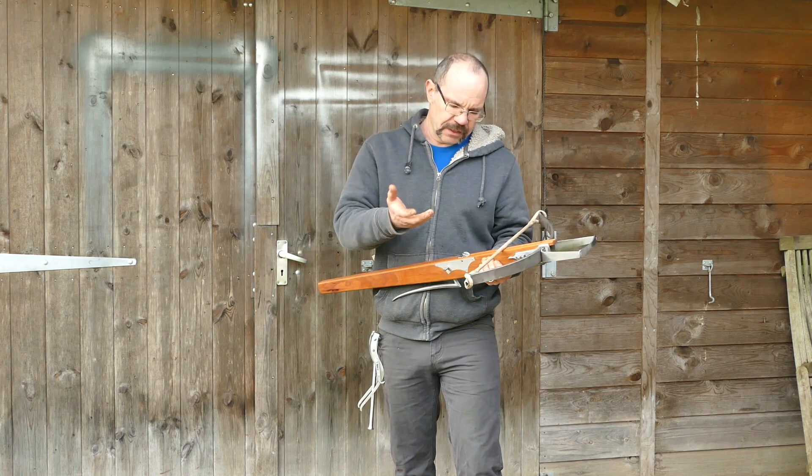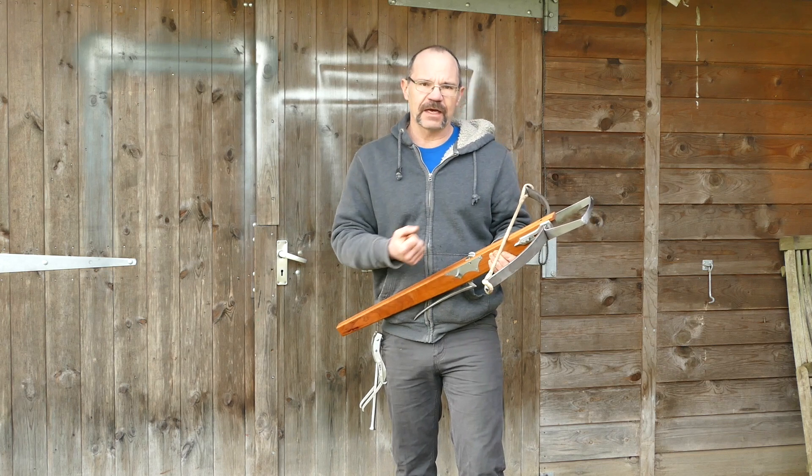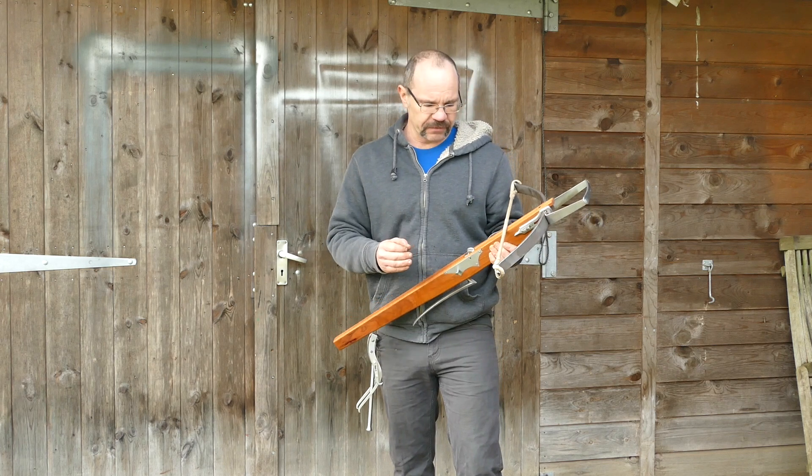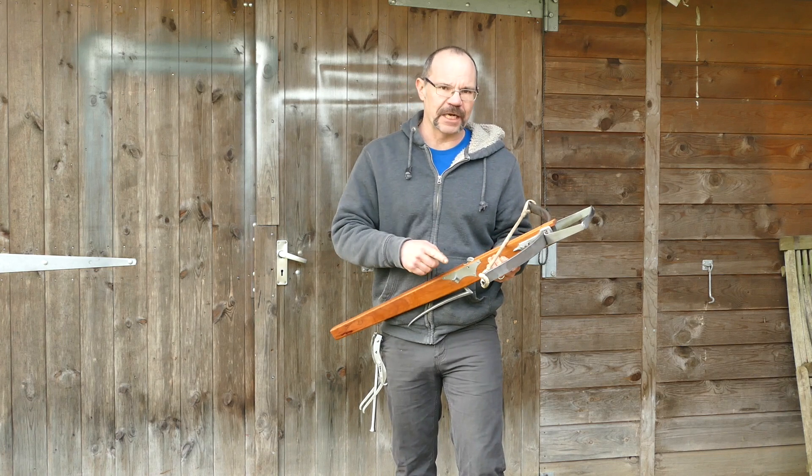So then you put your lever on — it's a goat's foot lever in this case. You do not let go of your lever at any point during the stroke until the trigger is fully engaged and you are sure of it, because if you let go of that lever it will become the projectile.